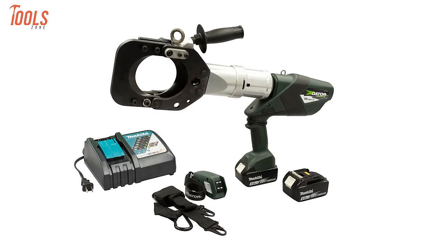The Mighty Rods Pro Cable Rods are a robust and versatile solution for cable installations. These rods feature triple-bonded steel connectors for extreme torsion and tensile strength. With 10 meters of 100% splinter-proof rods, they offer flexibility for overhead, underfloor, tight-angled, and obstructed runs. The MightyFix zinc-plated steel connectors boast a tensile strength exceeding 275kg, ensuring durability. The inclusion of a super-flexible low-friction SpiraFlex rod facilitates access to tight-angled points.